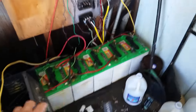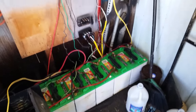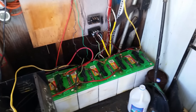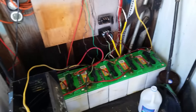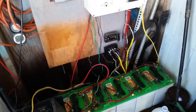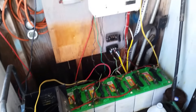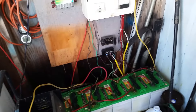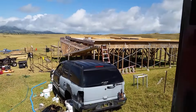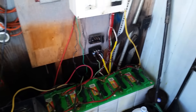In my case I don't have that on this house, but I have it for the new house, so I'm doing it manually. I put two and a half gallons of distilled water in there, I'm charging them a little bit, then I'll take off the charge, let them sit for at least four hours to equalize out. Then I'll put the solar panels back on to start boosting back up again. I was debating buying the really expensive inverter but I'm not doing that right now since my money is going toward the new house.